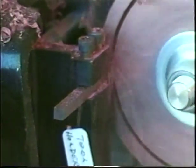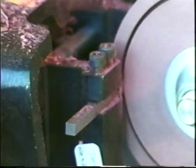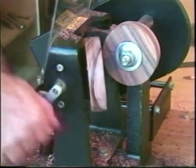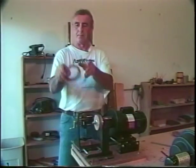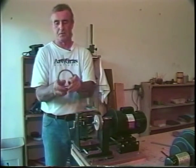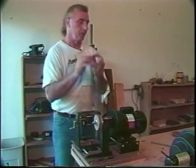Usually you'll find a lot of the exotic woods tend to be oily, and the more oily a wood, the more you're going to have these little chips binding up on you. So don't hesitate to back it off and knock those out on a regular basis. Here's our first ring — the other piece was a base. It's a nice clean ring.